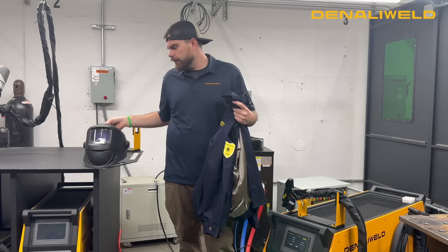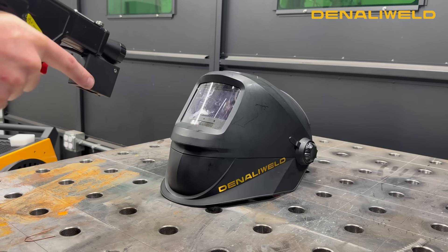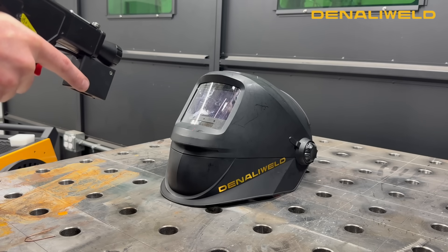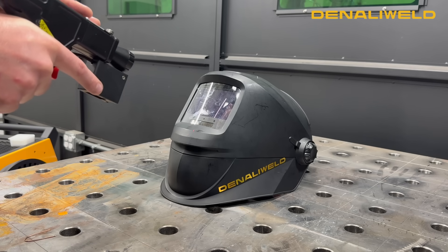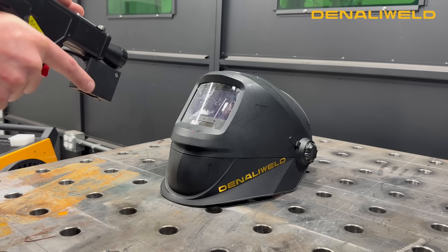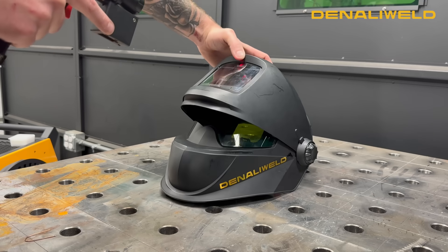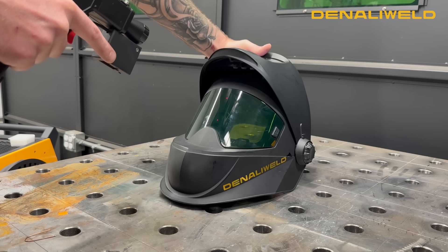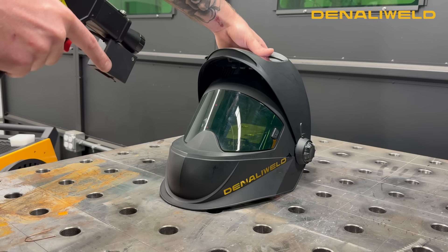Now let's get into the fun — let's see what this helmet can withstand. Today we're going to test our Laser Safe Welding Helmet. First, we're going to have the torch in remote cleaning mode, just for the safety precautions and the testing. Don't try to do this at home or in your shop. The exterior is your protective glass and your ADF — we're going to shoot that for 10 seconds. Then we're going to test our OD-6 Plus Laser Safe glass, rated to 1070 nanometers, for an additional 10 seconds. Let's see the results.